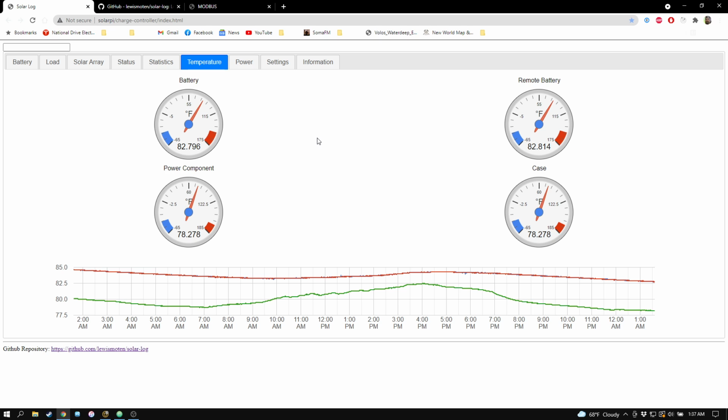They get drastically out of sync when there's an AC current going on. Like when the inverter turns on or starts getting a big load, I think the EMF from the fan spinning affects the equipment being able to sense the temperature. Especially, it's just the temperature probe that gets affected. You'll see a fuzziness on that, just on the red line. So I think that probe is more sensitive to the EMF fields than the equipment, but the equipment is set back further from the inverter.